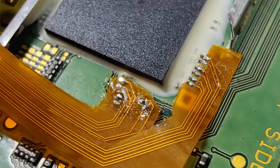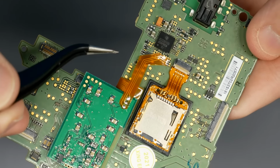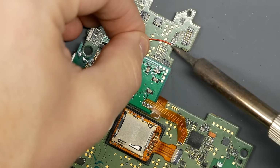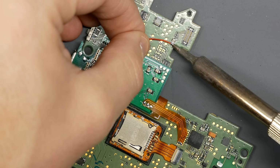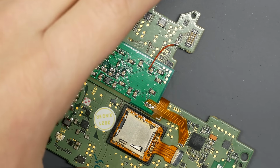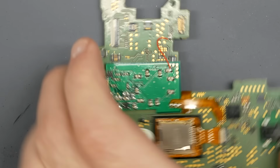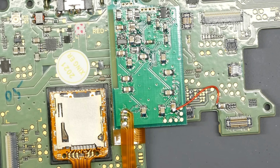I was able to eventually move it into place and start tacking it down, but it wasn't without trial and error. In fact, at one point, I thought I had it perfectly set, and then I went to test with a multimeter, and I was not getting any kind of connection or resistance to measure that connection on two of the points, and it was one of these through holes, so not fun at all to make that work. But eventually I was able to, and once you have that, it then folds around the board, and on the other side, you see we have our board that we added in, and with some double-sided tape, managed to sit it in place. I still have another cable, this one is for sound, and then we have a ground cable. The sound and ground cables are all perfectly fine, no problems, they're much, much easier than what I just dealt with, and then at this point, we're ready to fit it up and test it out.